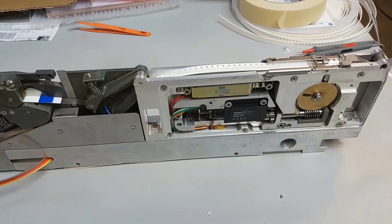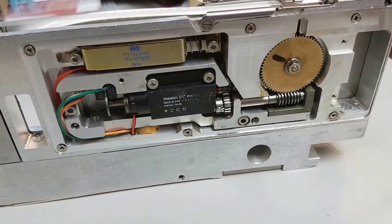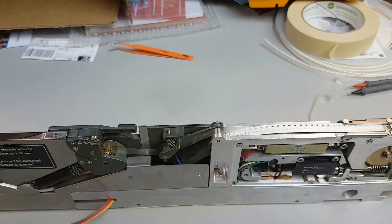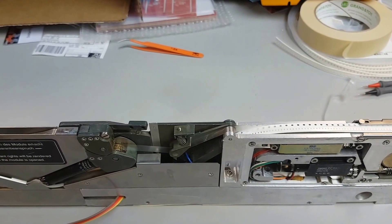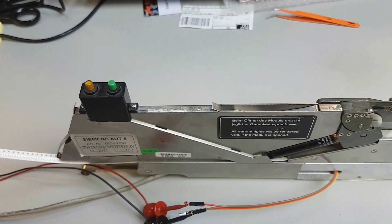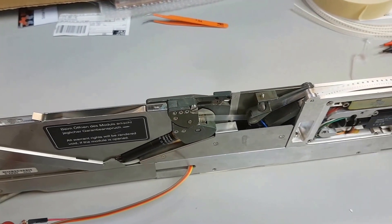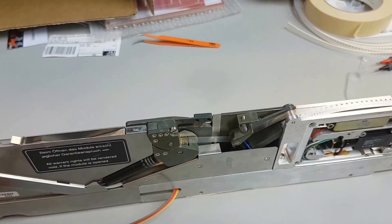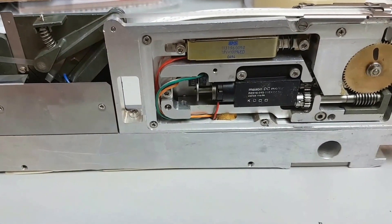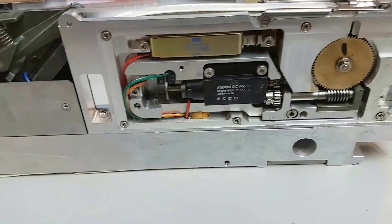This is moving 2mm per position. Currently the maximum speed I can feed through it is about 10 parts per second. These buttons here are about 20 years old and pretty bouncy as far as the electrical signal goes. So I've got 100ms debounce in the code — it's way too much, but it allows me to reliably test this and make sure the feed is because I've pressed it, and not because it's triggered 10 times as it's pushed down, so I'm definitely only moving one at a time.